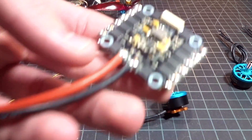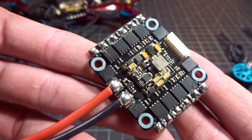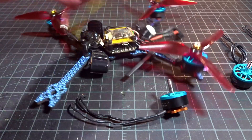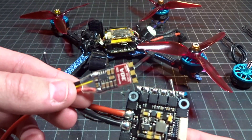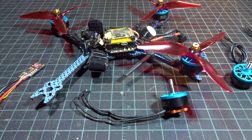For this example I'm using the Akon AK-32, a 6S 32-bit 35-amp ESC. However, I'm replacing the dead ESC by strapping a fifth Gemfan Maverick 30-amp 6S capable 32-bit ESC on the arm. They are not the same ESC, but it should work perfectly fine. On the old floss build the ESCs were not the same either and it worked just fine, and I've done it a couple of other times with no issues so far.